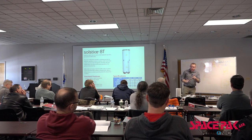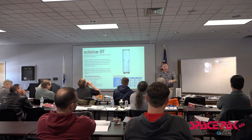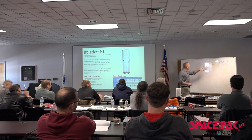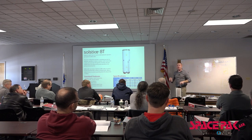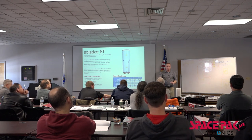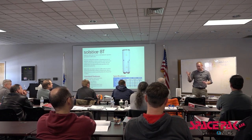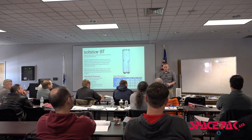Right, so the problem with that is that this unit is a 4-ton compressor. It needs flow and it needs water. It will heat the water up or cool it down so fast it will actually short cycle the unit. So we want water associated with these. We want them to run. These units run much more efficiently when they run for 15 minutes as opposed to 2 or 3 or 5. We want that water volume there. We know that every time your high efficiency boiler starts up, you never put your combustion analyzer in and then start the unit up, because that's the most unclean combustion it's going to have, on startup.